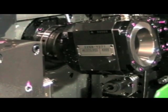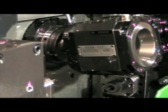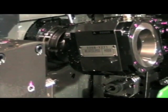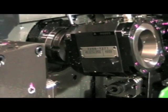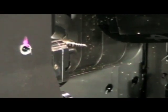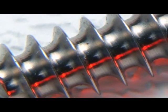Designers of medical screws understand the advantages of multiple start threads, which has led to a recent surge in interest in the ability to whirl double start threads. In order to whirl a double start thread, the whirling insert needs to be thicker than usual to cover the length of two full thread forms. The whirling head has to be designed not only to accommodate these thicker inserts, but it must also have a greater range of adjustment to cover helix angles that can approach 30 degrees. Machines with programmable B-axes are only limited by the clearance that can be put into the whirling cutter and aren't constrained by an add-on attachment. Many medical screw manufacturers use designs which require multiple thread forms within a single screw — it's not unusual to have to whirl two or even three thread forms on the same workpiece.